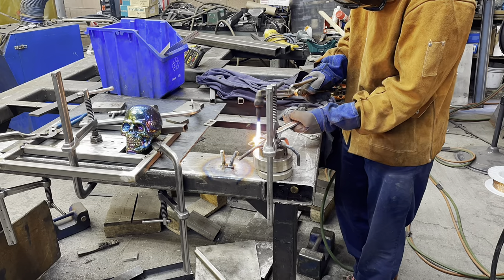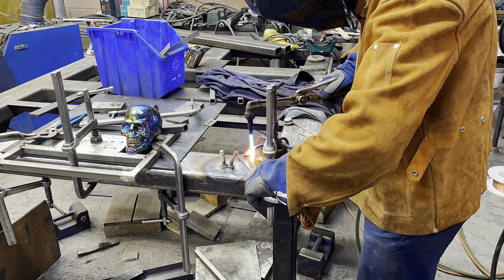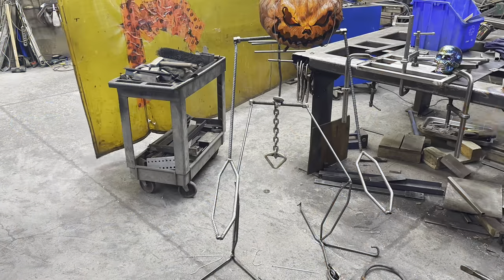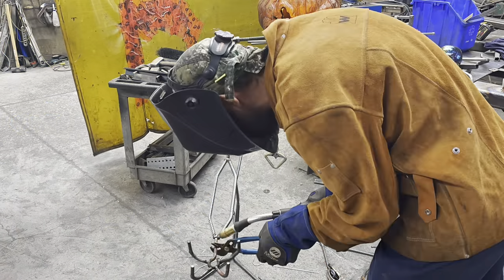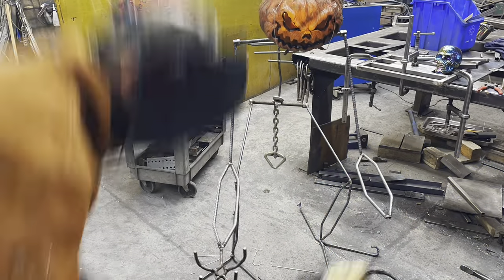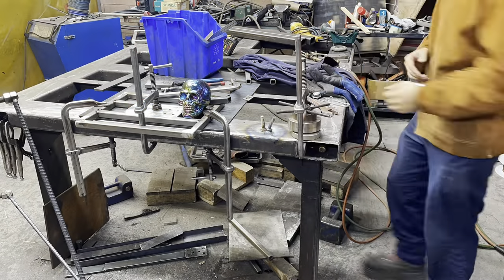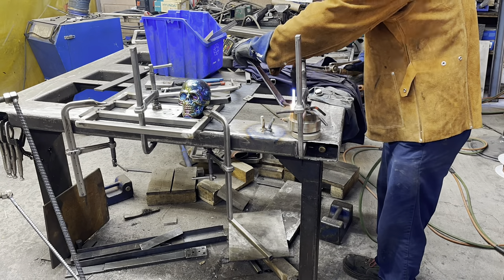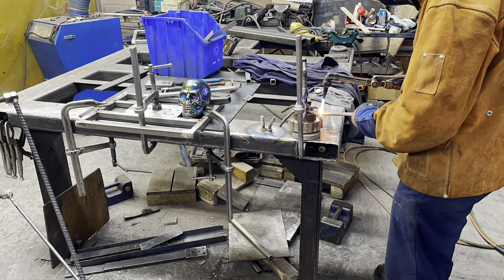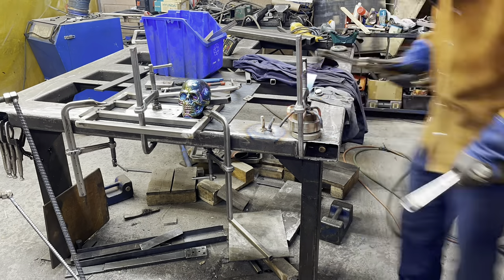This is a very easy process — I do it in a two-step. First you get the subtle bend, and then you get the main bend. My attachment process for the right hand is to tack it, then come back and weld it on both sides. Now we're on to building the left hand — same thing, same place, same kind of bends, same heating process for the same hand except reverse.